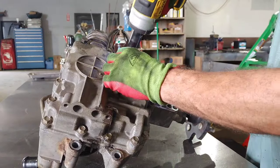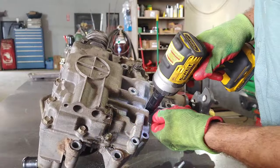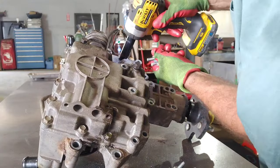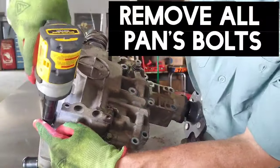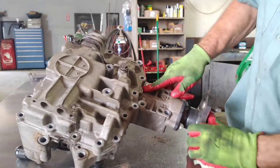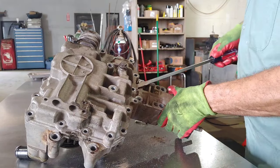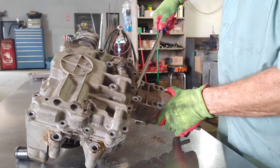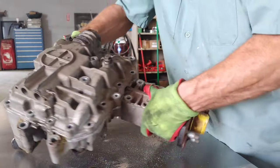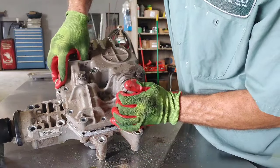You're going to take a 14mm. There are two bolts in the middle that are the two longest bolts, and the rest are about two inches to an inch and a half long — two different sizes basically. Once you get all the bolts removed, there are a couple of pry points. You really just need a small pry bar or a large flat blade screwdriver, and carefully pry it up. You always want to have this thing upside down, otherwise gears and parts are going to fall out. So now we're looking at the back — that's where the filter was.